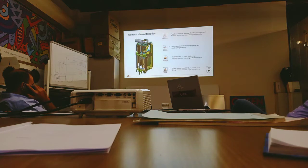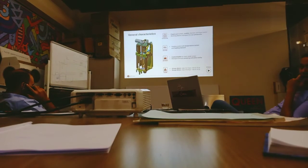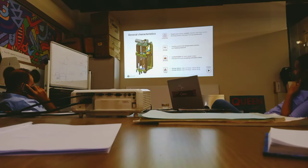The brewing unit can be 44 mm or it can be 50 mm. The 44 mm can accommodate a maximum of 14 to 15 grams and a minimum of 8 to 10 grams. The 50 mm diameter can accommodate up to 20 grams and a minimum of 8 to 10 grams.